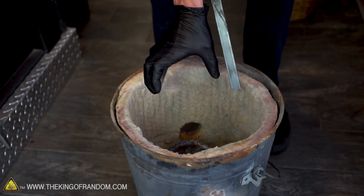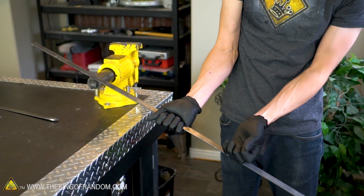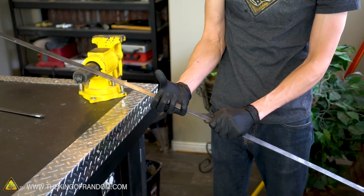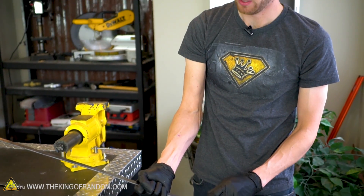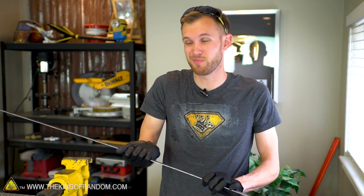We'll then take another piece of steel and bolt that onto the end in sort of a claw shape so we can really grab onto the crucible. If we just take more of the steel bar and double that over, that'll give a nice handle that's easy to hold on to. I will still be using furnace gloves, so I want something easy to operate that doesn't require a ton of manual dexterity. This is all very much an eyeballed experiment — if you want longer tongs use maybe the whole bar; if you want shorter tongs, just use less.